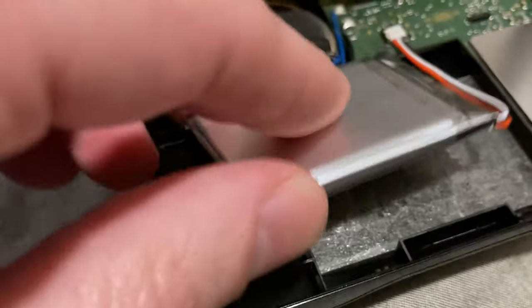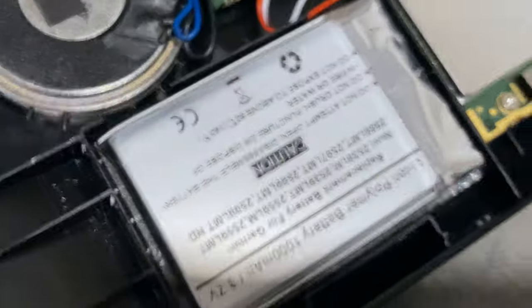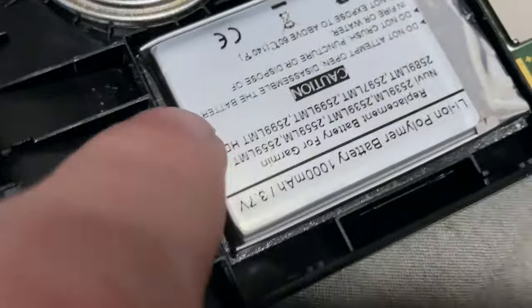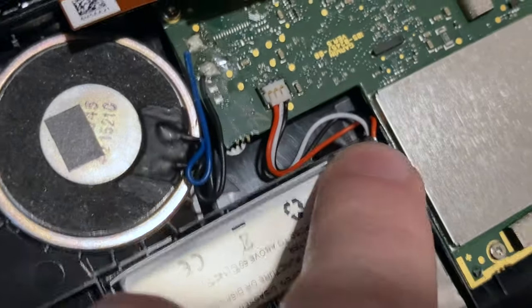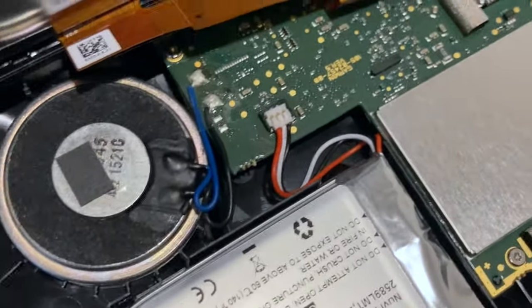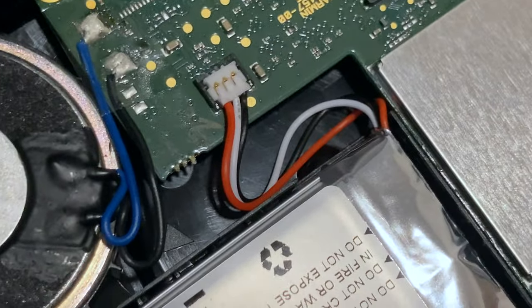You can move the battery around to find a way to route the power cables. I had to fold the wire over like that and then push this back down on the adhesive tab along the edge, and just press that down. The heat cycling of the unit during charge and discharge and sun exposure will be more than adequate to adhere the battery.